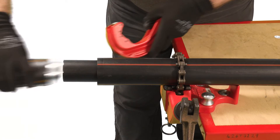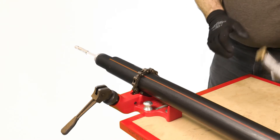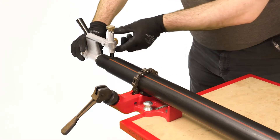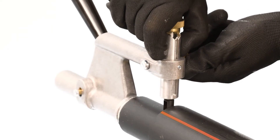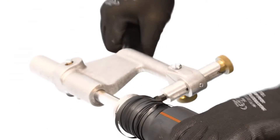Place the preparation tool onto the shaft and slide along by depressing the release button to disengage the drive until the cutter tip is aligned with the marked socket depth. Position the cutter tip 1mm above the pipe surface. Apply the spring tension to the cutter tip, then rotate the tool clockwise until the cutter has moved over the full length of the pipe. A continuous ribbon of PE material should have been removed.